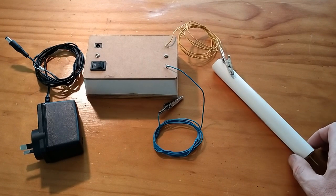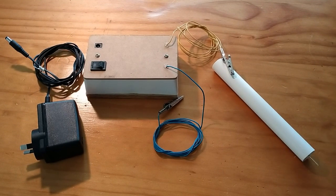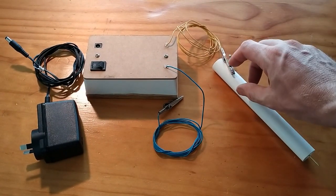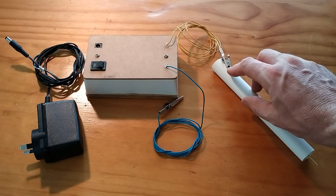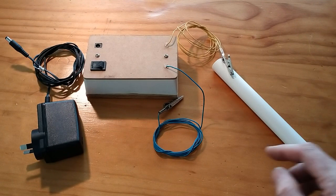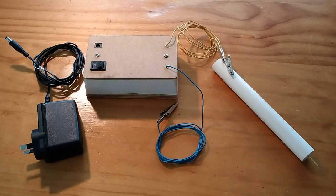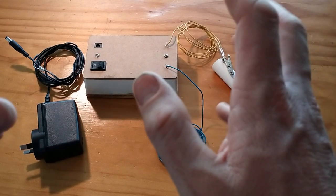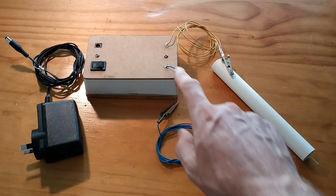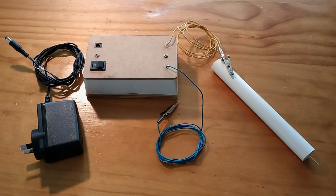You'll also need to make an electrostatic chamber that mounts to the front of your gun. As the powder comes up and enters through this end, you have the high voltage wire — the yellow wire — connected to a rod, and as it exits out here, it is charged. The workpiece is connected to this blue wire, and as the powder comes to it, it clings because of that electrostatic nature. So I'm going to show you specifically how to make this chamber.